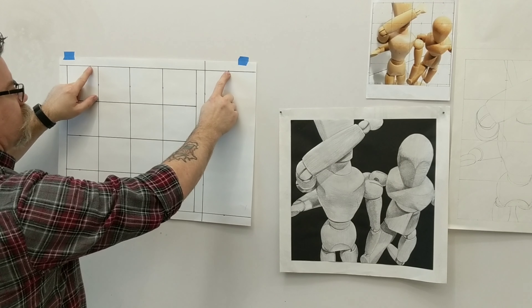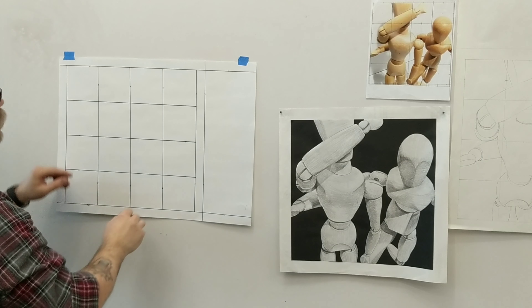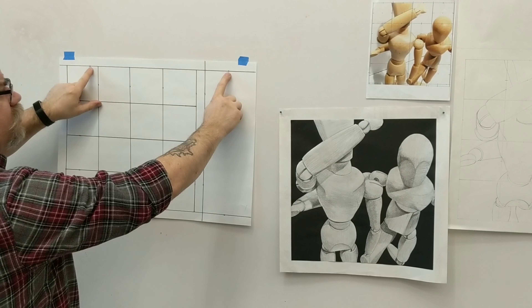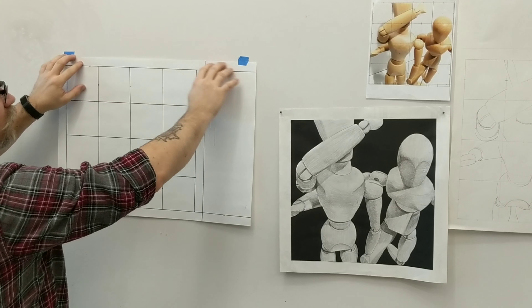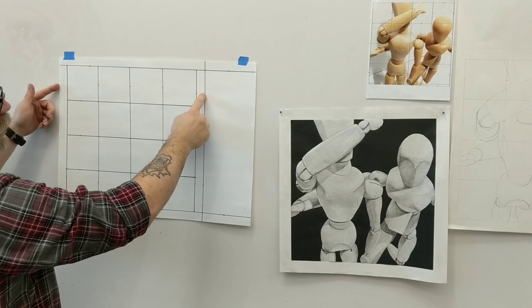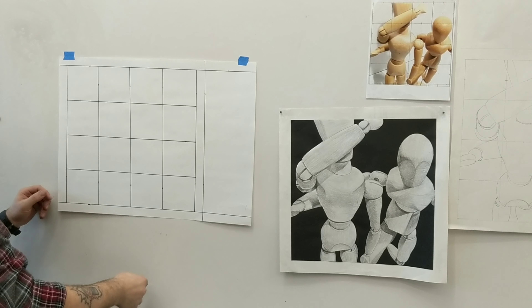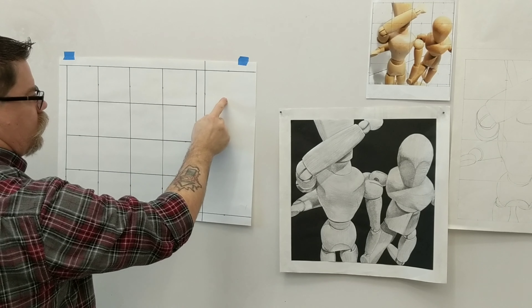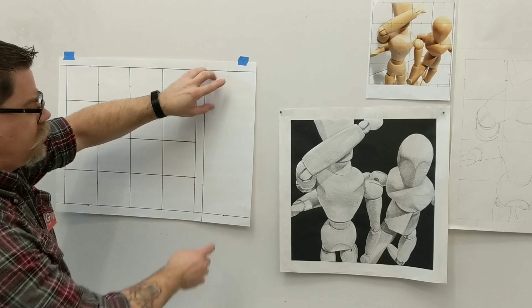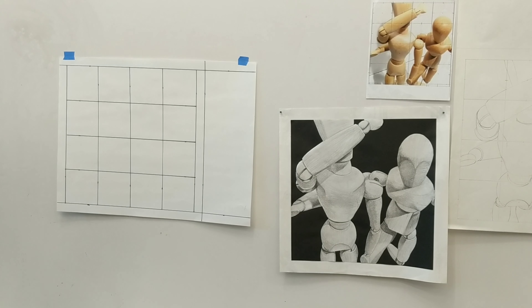You have to have two marks. Every time I made a line, I measured and put two marks. I measured one inch from the top twice — I've got two marks, I can connect them and know I'm right. I put two marks at 18 inches, one on each end, and when I connected those I knew I was right. If you only make one mark, where you put the other end of your ruler could be anywhere. You need two marks to line it up properly — probably one of the most important things about doing this.